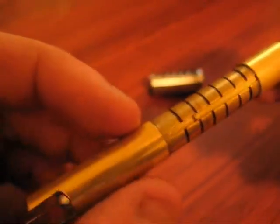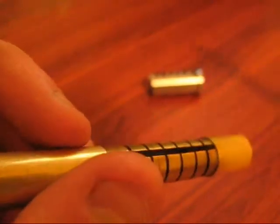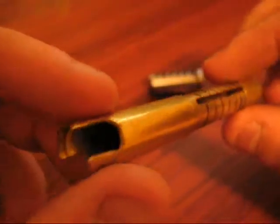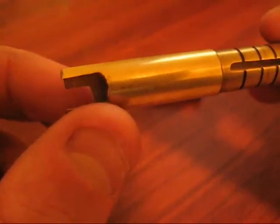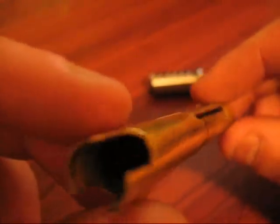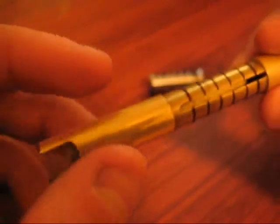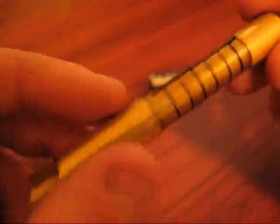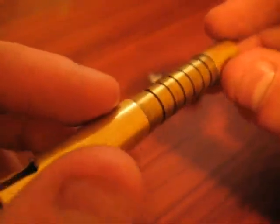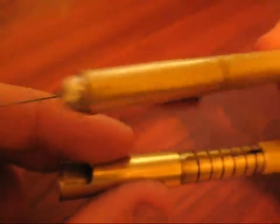Well, this is the tool. You can see it consists of two parts. I've got it up close so you can see the details, and also because of the next portion it's going to be up close so I can adjust the focus on this camera mid-video. You can see the end bit is notched out — that's to accommodate tension tools and also the M3 slider bypass tool. These end bits here that are raised up don't serve any function other than calibration of this end bit right here, and also just support the tube so it doesn't collapse as easily, which is not fragile by any means, but every little bit of strength helps and it doesn't add any complications, cost, or anything to the tool. We have this slot right here so we can see into it, so we can see that little mark on this other tool that goes inside of here.